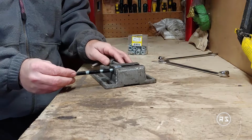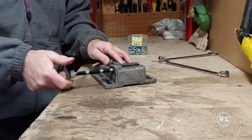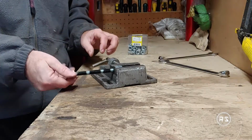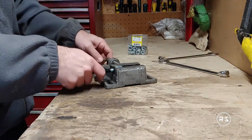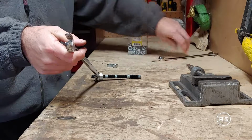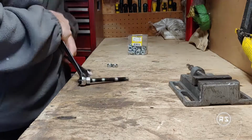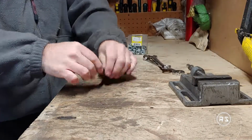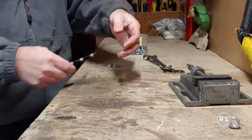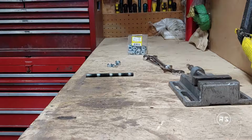If I want to put it back, it's also very easy if I'm not dropping the nuts. So you see, it's super easy to get in and out. So that's how you fix the end of a rod after you cut it. And now that I'm done, I can unlock my two other nuts and take them out of the rod. When you do that, make sure not to squeeze your finger between the two wrenches, because it's not pleasant since you're applying a certain force. It's pretty hard.